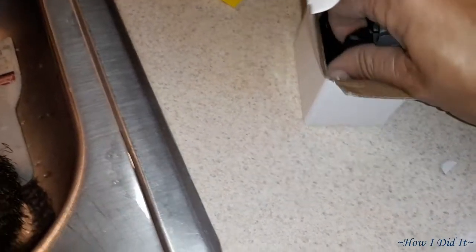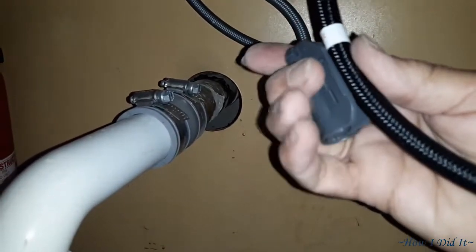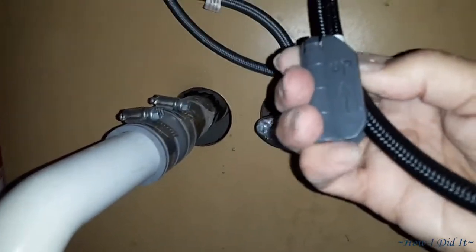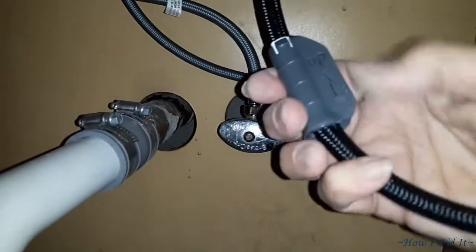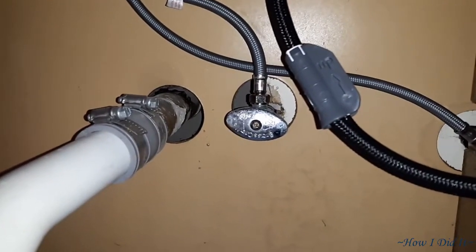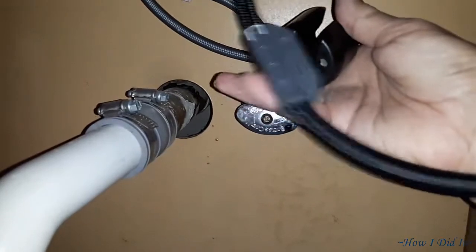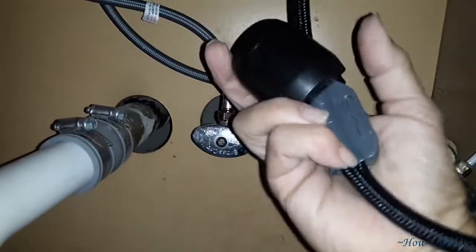Even the weight that they put on these faucets, the new weight is different. So you just snap this little plastic, let's call it a weight retainer, onto the hose at the mark, and then the weight just slides over the top of it. In the past you had 2 Phillips screws that you had to tighten down, or 2 Allen screws. It's just way easier. Just totally amazing.